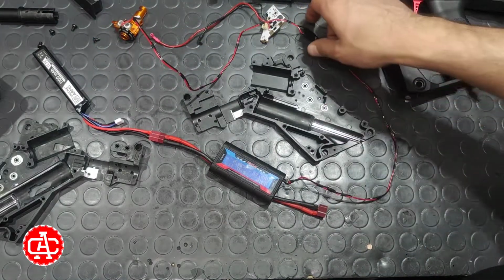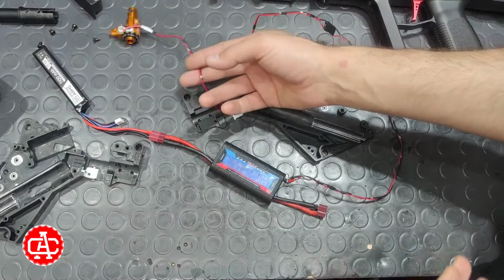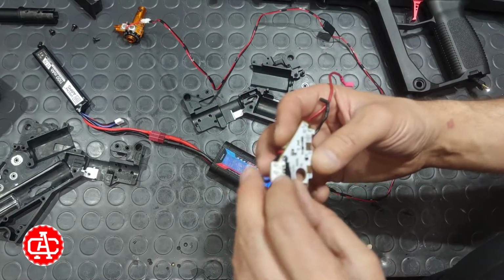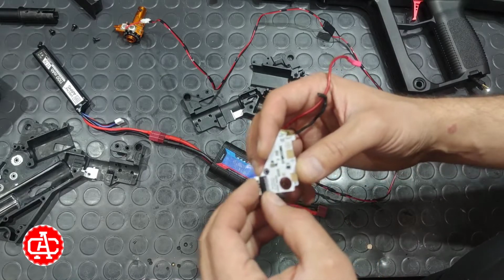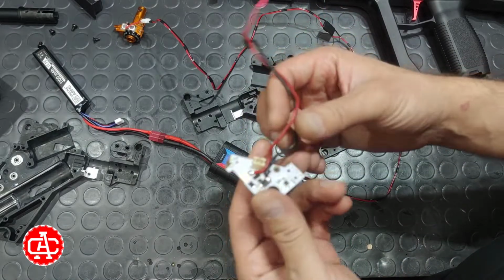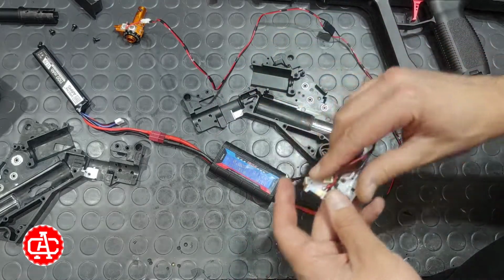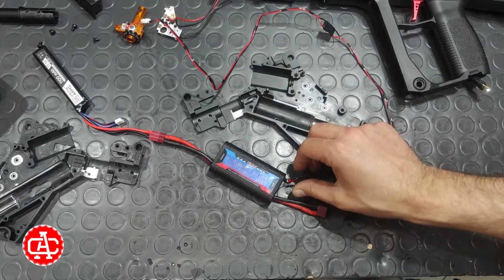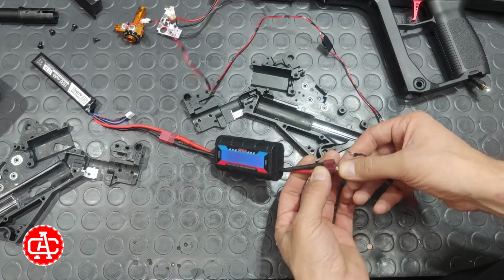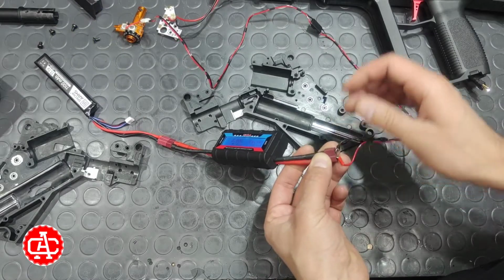Well, we thought for a second that we would need a MOSFET in order to control it, and actually connect the MOSFET to the micro switch, which is not so micro, to the trigger switch, and make it a little bit more complex. But since the consumption was only half an amp, maybe we are not going to need it. You can clearly see what the consumption is.